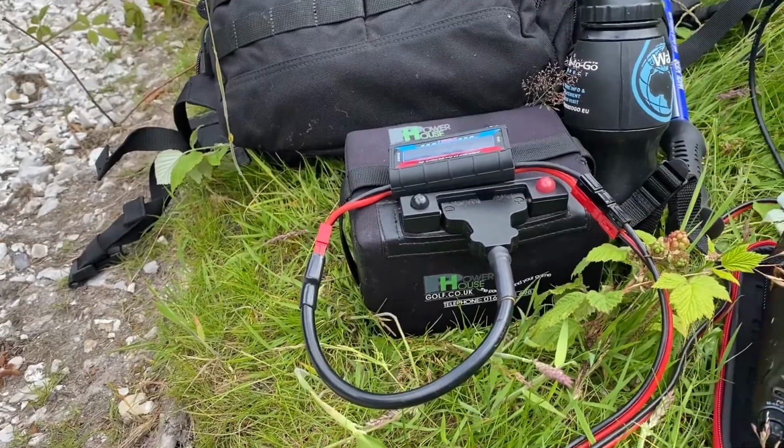One thing I have found with this antenna is that having that coil down here is quite heavy, and I found it either tends to really pull the pole over or it tends to drape on the floor. So that's possibly the one downside of having all the way up to 80. And I am planning to make a 40 metre and probably just a 20 metre version as well to get them lighter and smaller.